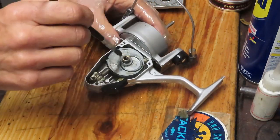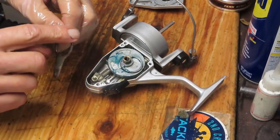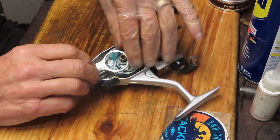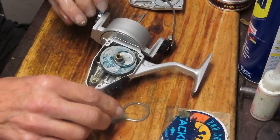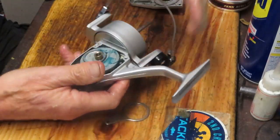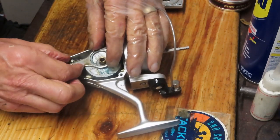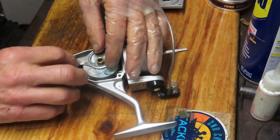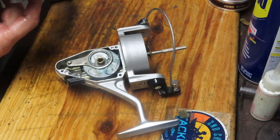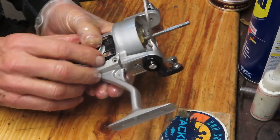All right, that's in. A little bit of grease onto the face of the main gear where that arm is going to ride. We mentioned with the arm that there's a rounded side that faces out. So we need to do a rotational kind of thing here. You can work this. Find the top end. Mount it onto the post. Now normally, I'm not seeing it, but normally you would have a little copper washer on there, but I guess the bushing being what it is is doing both. So we should be able to close the case up now.